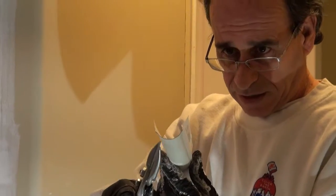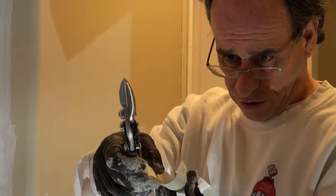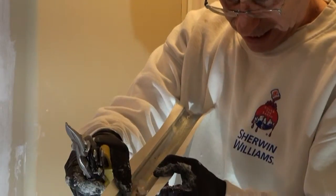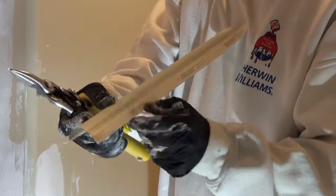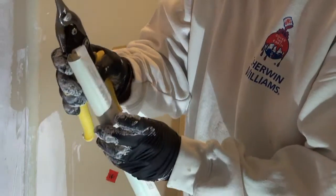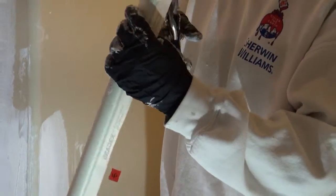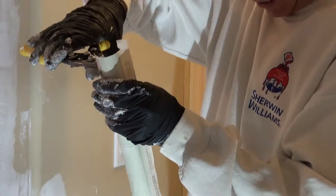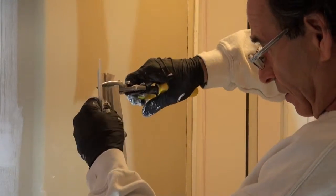The round bead, as you can see, has a round profile, and at the edge there's a little bit of an indent that sticks against the wall. That gets filled with mud from these sides over here. Now when we cut this, the problem is that this ridge gets flattened out, so you need to try to cut it as straight as you can across using one motion.